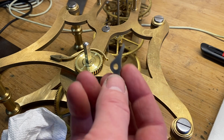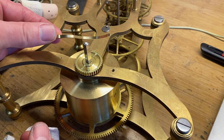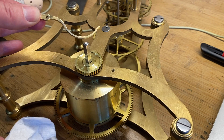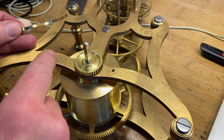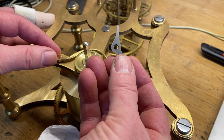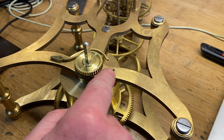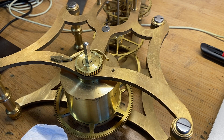Here's what we have so far — I've got the click main and the click spring made. It came out nice. It's got a relief on the bottom so it shouldn't mark up the frames, and I've got the holes drilled and tapped. What I'm going to do now is heat treat this click. I also have to make a screw and pin this properly, then we should get this whole assembly working.